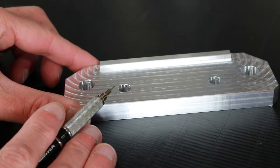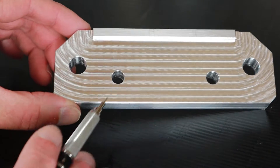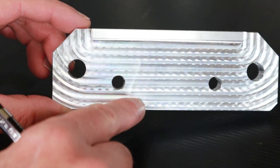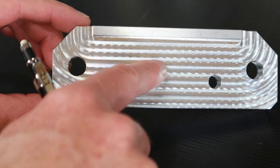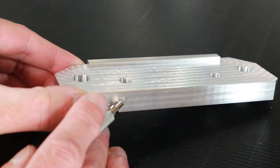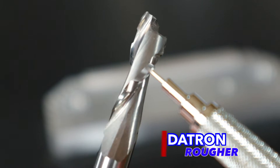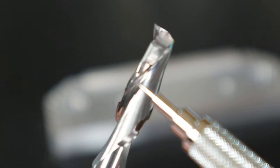Overall, I'm really happy with the part. I think it came out good. Now, this is a roughing tool, but the floor finish it makes on the surface when it's facing is really nice. I can touch this — it looks like there are lines in it, and visually there are, but if you touch this it's totally smooth. On this surface right here, there are three lines and I can feel them. In the tool itself, you find that one flute stops and another flute picks up, and I think that's what we see here in this surface finish.